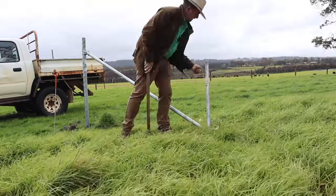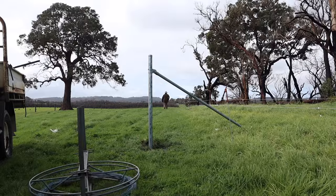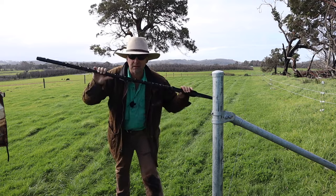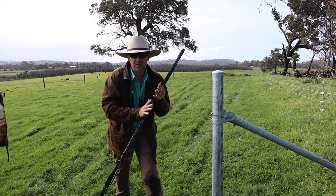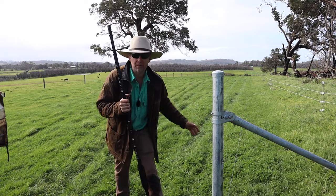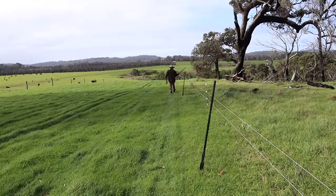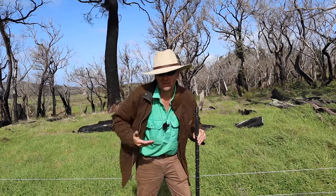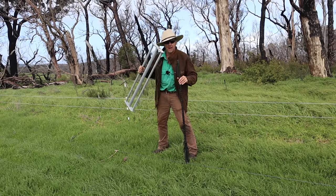With the end assemblies quickly installed at right angles to the internal corners of the fence line we ran out a ground wire to start placing the line posts. Now this is the star of the show — it looks like an ancient hunting spear or something like that but this is the insulated line post from Gallagher and its fiberglass reinforced core means that it's flexible and strong. They actually recommend using this instead of steel or timber posts. We've got our bottom wire strained up now between our two end assemblies and we're going to space these out at a 10 meter spacing because you don't need as many posts in an electric fence installation as you do in solid fence installations. I think these are the easiest permanent posts I've ever run out on a fence line. There is a special driver for putting these posts in but it's so light it's going to make putting posts in all day much easier work.